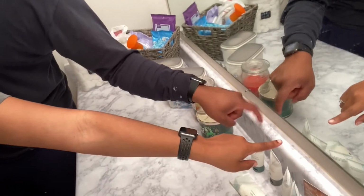Something I would do differently: we struggled around the sink and around the back part, the baseboard part of the countertop. You saw us struggle. At first we were just cutting the length of a piece and then peeling and rubbing it on as we go. When you get to parts like the sink bowl or tight corners, cut the piece before you take the paper off. It probably is common sense, but it's 10 times better. We had to peel up some pieces and then re-put them down.